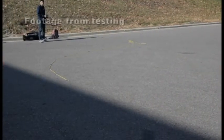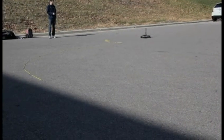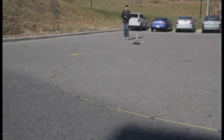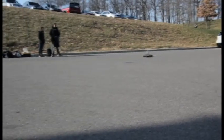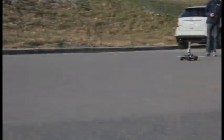This footage was taken from when we were testing our prototype. Our track consisted of an 11-foot turn radius that we tried to keep our car on during testing. We initially tested the prototype with the manipulator arm held in the home position, then tested it with the arm shifting to prevent rollover. Our tests indicated the arm reduced the roll angle by approximately 10 degrees.